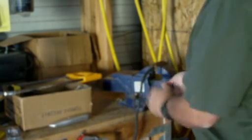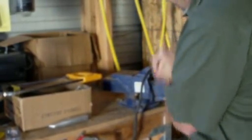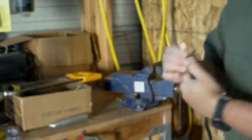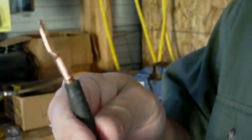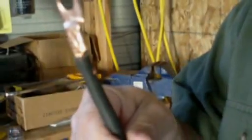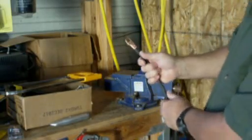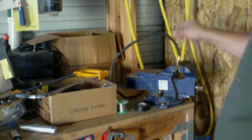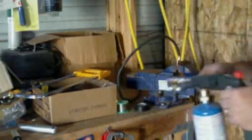What we want to do now is put that in the vise and crimp it. We're going to turn the vise and compress the terminal. It has the marks of the corrugated front face of the vise on it, which gives you a fairly decent mechanical bond. I've put the cable in the vise, as you can see, and now we're going to get ready to solder it.